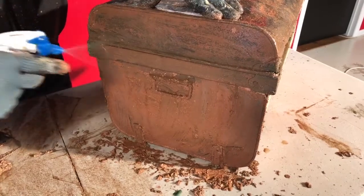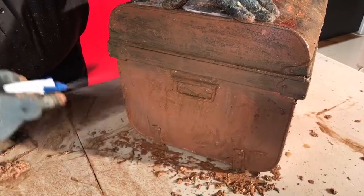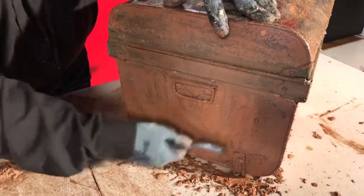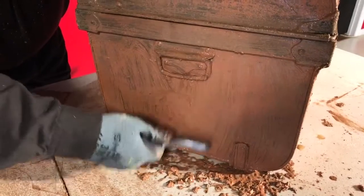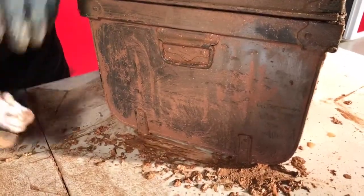Usually only flush at the end stage. Now the reason we use a paraffin based spirit is, one, it's nice low odour, but also it stays wet way longer than a normal solvent. If you're using meths or thinners, your typical lacquer thinners, it really stinks. Get as high as a kite on the stuff, and you can't work in the same room as it. And meths just dries way too fast, and you don't have any real scrubbing time before it's dry. With the paraffin based rinse and the flush, it gives you extra work time.